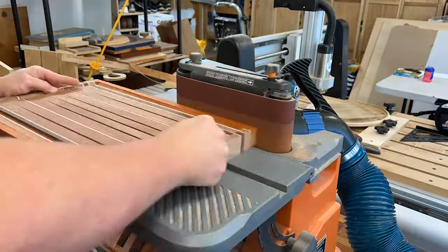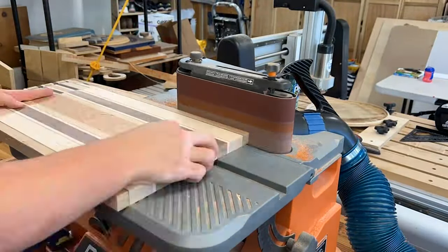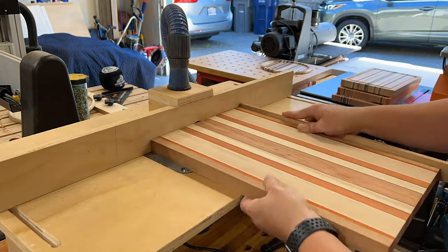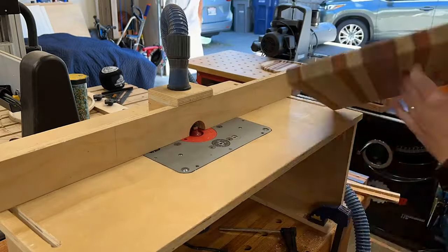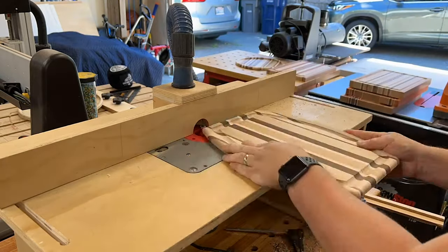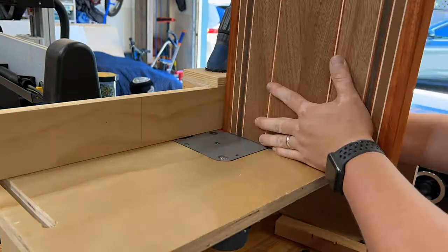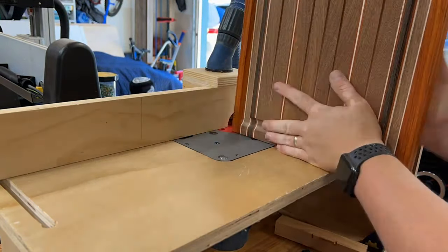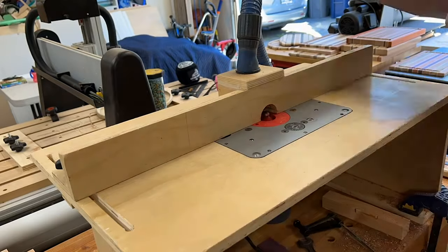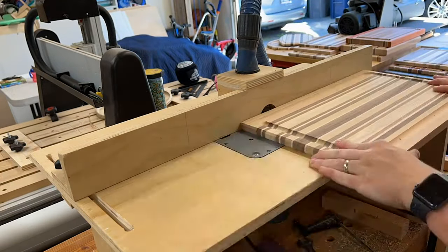You're going to do sanding and all the traditional cutting board woodworking steps — I cover those in Cutting Board 101. But here are some different techniques I tried with this batch. Router profiles really change a board a lot — you can do these on the CNC but a router table is easier. You can do a round-over on top with a square bottom, a slight or heavy round-over. For this deluxe board I went with a subtle 1/8 inch round-over — a really nice look. You could also do a chamfer for that 45-degree bevel.